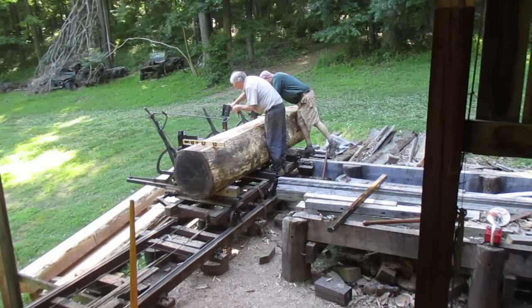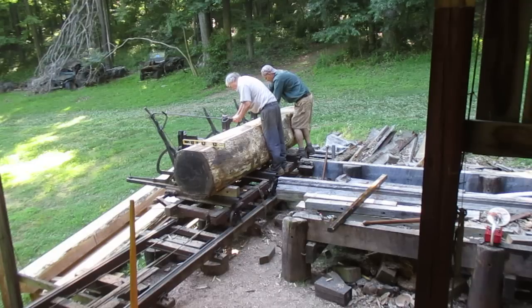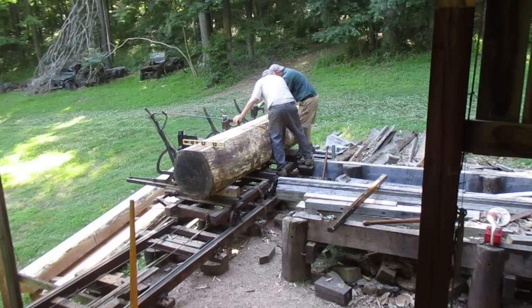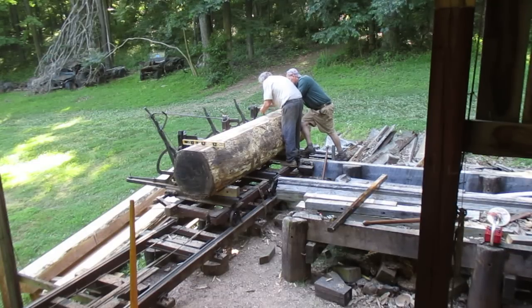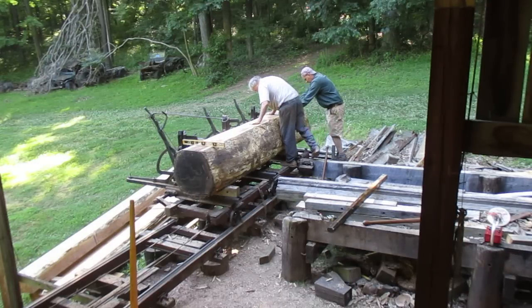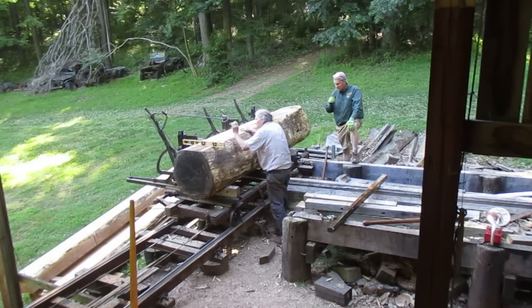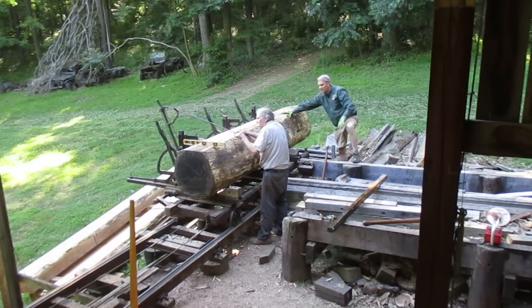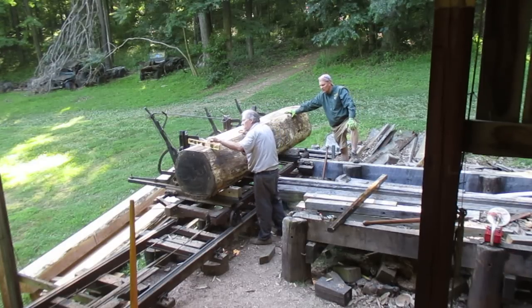Now, instead of pulling the slop out, we're pushing the slop in, so it's got just a little bit of drag in it. You follow? Yep. Pull it out. No. Slide over. See, you got slop here and slop here. So when you dog it originally, you want to dog it here so it doesn't have any slop. What we're doing is putting slop in there and letting it go down and letting it take its own slop out. That's the plan, just so I can get this level. Once it's level, it will be loose. See, now you're in the line. See how you're in? Yeah, it made a difference. See how you're just barely touching the one line, but you're inside the line.